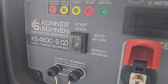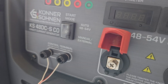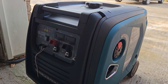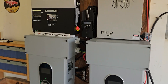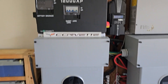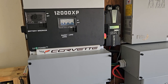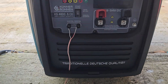I'm going to use the inverter to control the starting and stopping of the generator. In my setup, I have it set to 40% — once my battery gets to 40%, it will automatically start the generator and recharge the batteries. The inverter I'm using is the EG4 12X — the 12,000 XP — and I have two 48-volt 280 batteries. Let's hook it up and see if this will charge my batteries.